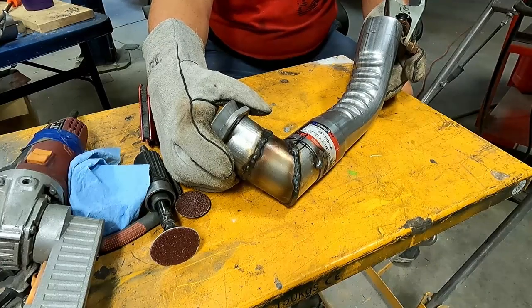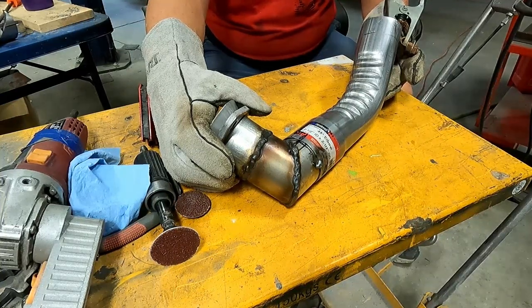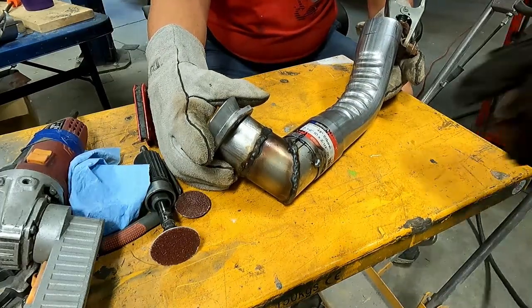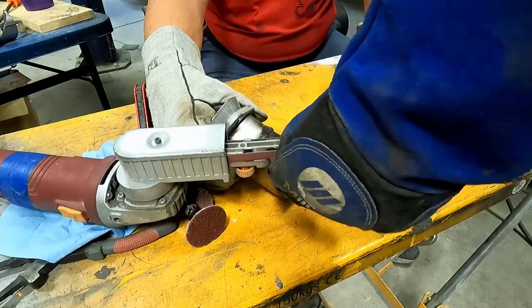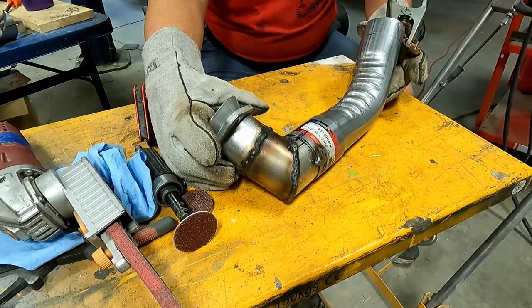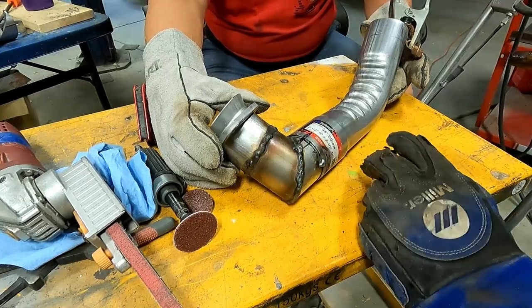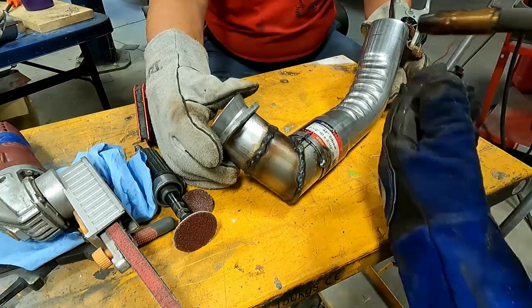We'll weld it all up. We'll just take it and do like we did the other ones and do an inch or so. I don't want to burn through and put all those burrs inside. We're never going to be able to get this reacher tool down in there, so I'm just going to be careful. Plus, I'm not butt welding. This has got metal underneath it. Yeah, it's underneath to there. Yes. So if I just seal this edge, I think we're good. Yes.